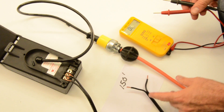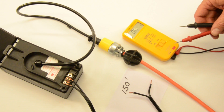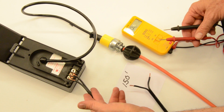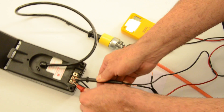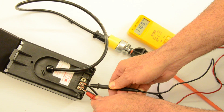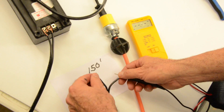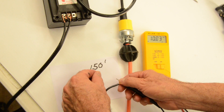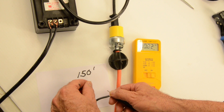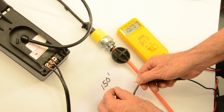We went out and put a second light fixture on — the second fixture was 13 watts. Back at the beginning of the wire at the transformer, we're at 11.6 volts. Even at the beginning of the transformer the voltage will drop as you add load to your wire. At the end of the wire out there at 150 feet, we've dropped down to 10.83 volts — we're still fine. We've added 20 watts of LED lights to the line, both of them quite bright. We're going to add a few more and see where the voltage goes at 150 feet.